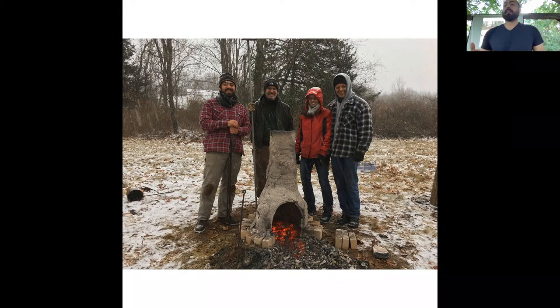In our case, we were mixing it with some sort of sawdust and some water, and it turned into whiskey at some point because it just sat and fermented. But the idea is that the sand, because of the air blast, can go flying out, so we want to bind it together with something. You can use charcoal dust and water to make these really gross black mud pies that you load into the furnace. Generally, we're doing about a kilo of ore and a kilo of charcoal every 10 minutes, and that goes for the entire time.